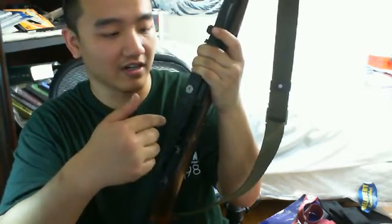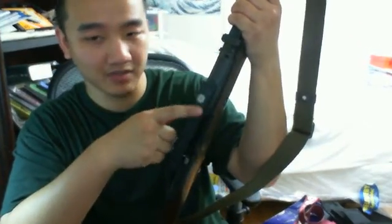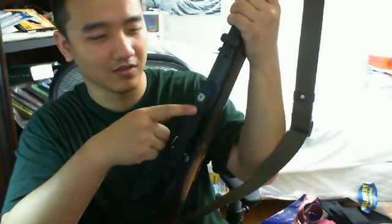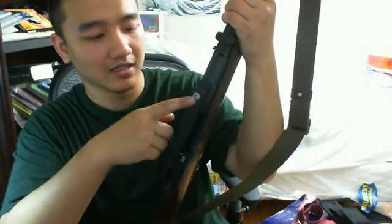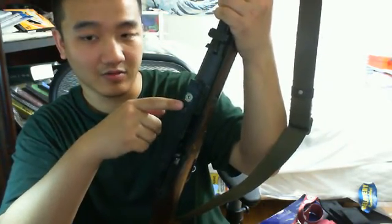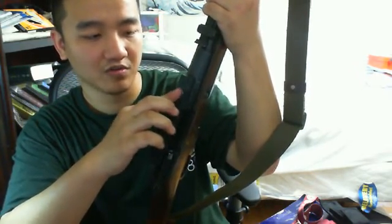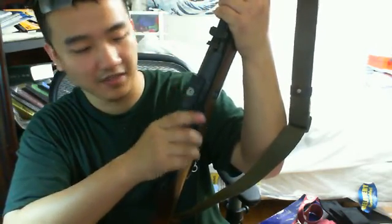So what you do is you drill one hole, right? You screw the screw in there, make sure it's tight and fixed, and then you do the second hole. That way it's almost guaranteed perfect, so that you don't offset one drill hole and mess it up. Now if you do mess it up, what you have to do is go 2 sizes up. There's a drill tap chart online you can look up. I think the next one is like 12-28 or something like that, and mine's 1/4-28, which is the second drill size I went up. And as you can see, I ordered this bolt online, and the head's quite big, so I use a large drill to cut out a larger hole for that drill head to fit.